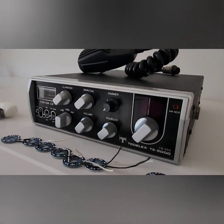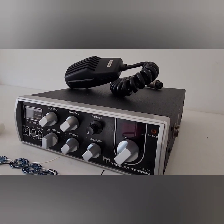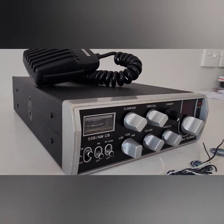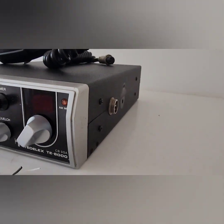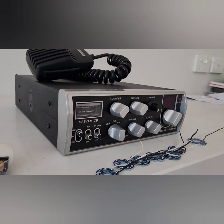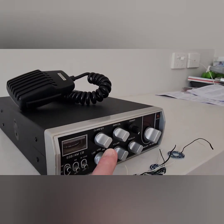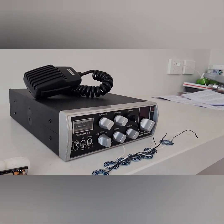The process is to remove the channel selector, the purple screen, as well, cut and polish that to brand new. Also dismantle the meter, clean that inside and out, and polish the main display. All of the gouges around the edge of the bezel will all be removed. And any other marks that are deep in the panel will be filled and spray painted in original colour. This is not the original colour. I can get a closer match to the original panel with the paints that I have.